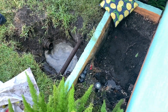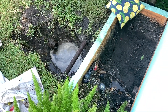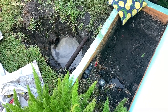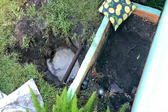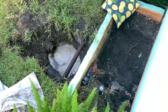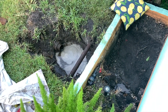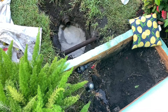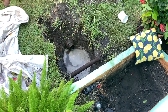This pipe has a fairly decent pitch coming off the building, so it should flow well. We're going to have to put some fittings in to jog it up because we can't go straight from here to there with that pipe in the way. And what the heck is that other pipe? Could be gas — but a gas pipe should be about two feet deeper in the ground. The building was made in 1946, so who knows. It could be an old water line or an original water ring. You certainly don't want to cut it with a saw just in case.